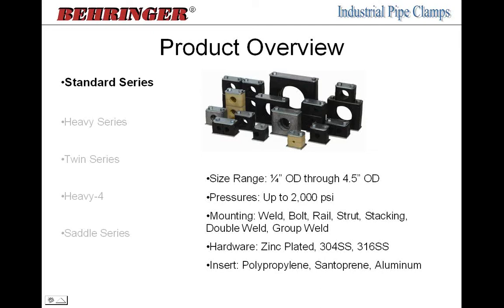If you have a system operating at 3,000, 4,000, sometimes up to 5,000 PSI, but it's very static with no dynamic loads, no vibration, and a small closed loop type system, you can get away with using a standard series at those higher pressures. System design has to come into play here — this is just a base point to start from and decide what clamp to use.